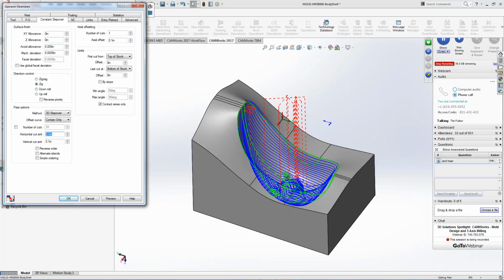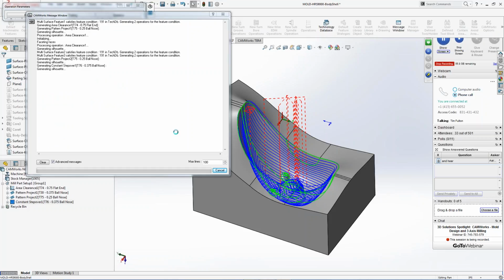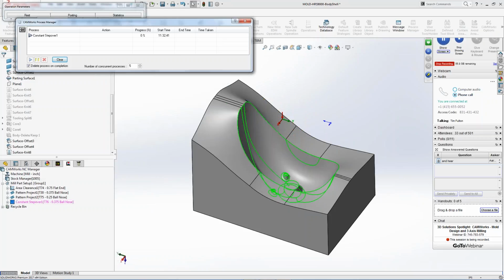By setting your defaults a little bit larger, it allows you to get the concept. Look at the toolpath, see if it's something you would like to run, and then you could fine tune it, right? I can knock this down to 0.02. I hit the preview button, sorry, 0.02, make it even larger there. And it'll take that toolpath and it'll start fine tuning that toolpath now. So that is the basic way of getting the concept down and then going through the calculations inside there.